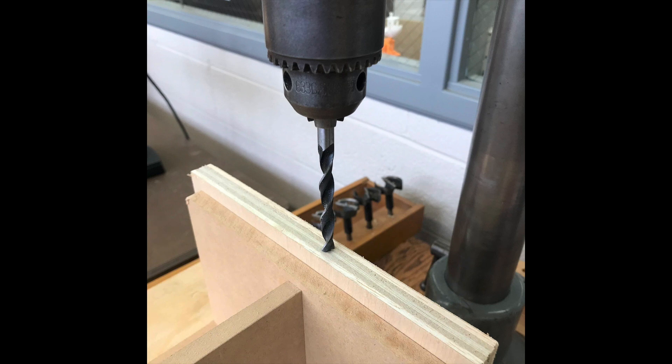When you want to cut a hole for wooden dowels, either you use a drill press so your drill holes are really perpendicular to the work surface, or you use another guide. I would not suggest to do this freehand, because it's very difficult to control making a hole that's really 90 degrees down, when the outcome later should be that all your joints perfectly match.